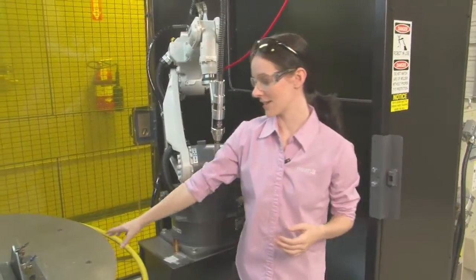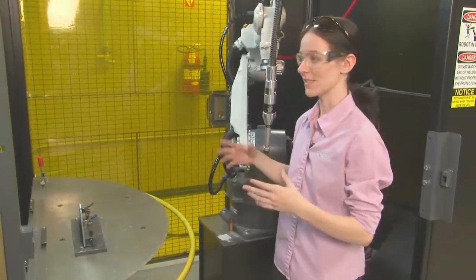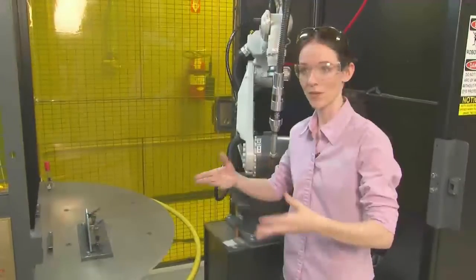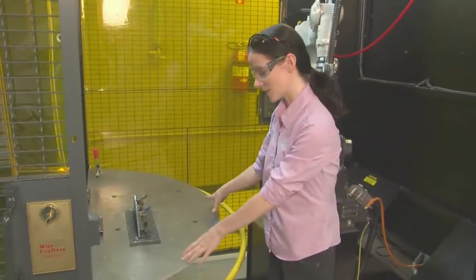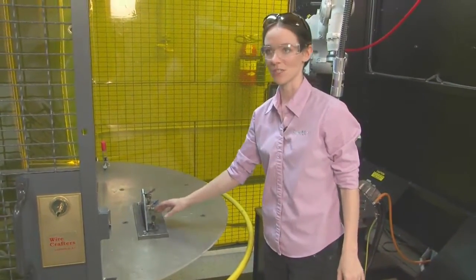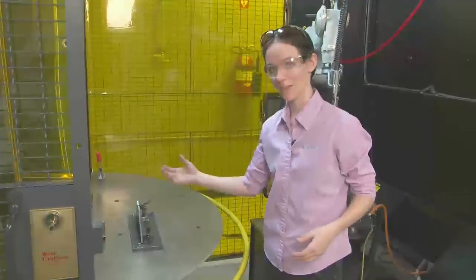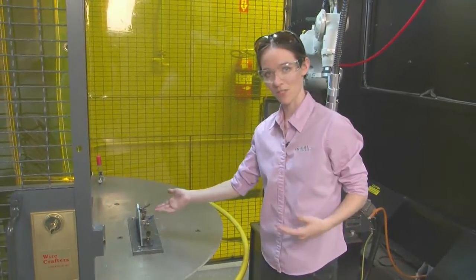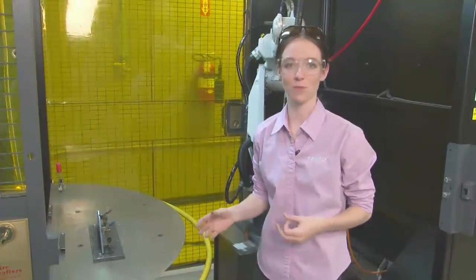This position has to relate to what's on your table. This system is a unitized cell, which means it's self-contained. I can pick this up, put it anywhere, hook it up, and we're good to go. But what we need to do is get the fixturing right on our table. What we have here is a simple fixture — it's just to do a fillet weld. The robot is able to come in, manipulate the torch in the proper position, and weld it out the exact same every time. And that's key to what a robot does.